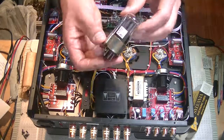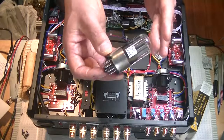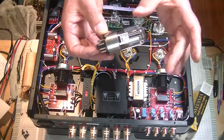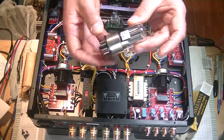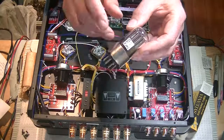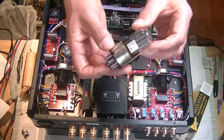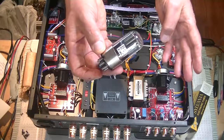Now, for the R8, one of my favorite 6SL7s is the Melz tube. And I've been having a hard time keeping these in stock in matched pairs. People buy them so fast. What happened is I got in a nice bunch of new old stock Melz tubes. Nice clean looking tubes, testing good, nice and strong. On my tester, nominally 80 is new old stock, so 86, 81, those are good numbers. Very nice clean pins. So I managed to make up 8 pairs, and I swear I had them in the store for no more than half an hour, and somebody bought the first pair.